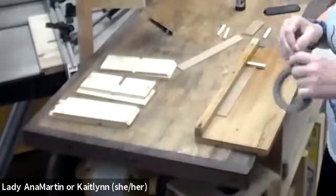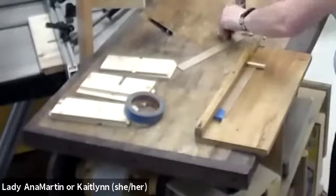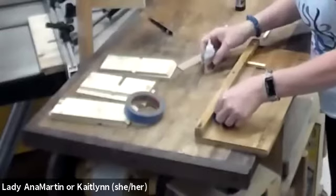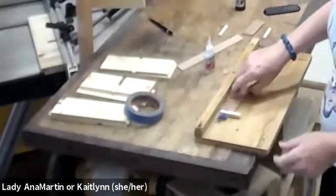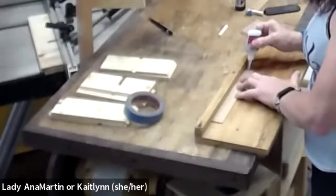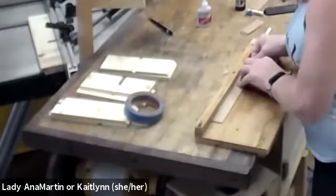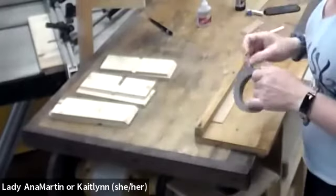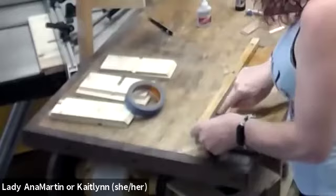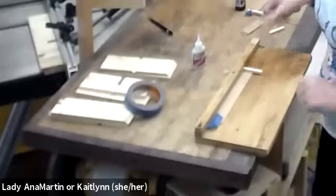You're going to have to ignore the tape. This is what we're using for hinges. Now I'll just hope that the glue sticks to the tape too. So what I want to do is build something called a parallel. We use these in theater a lot to build risers. You want to be able to lift the actor or the set piece in the air a bit, but you also want to be able to store that stuff later on. And you don't want anything to get lost along the way, which it absolutely will. Am I in the frame? Good, good.